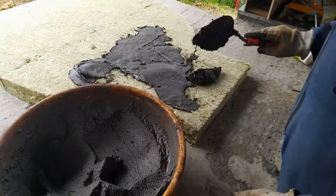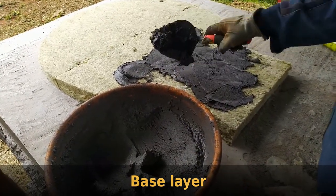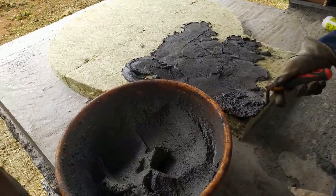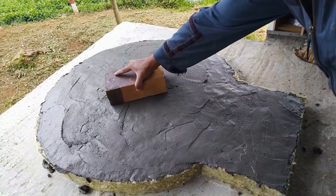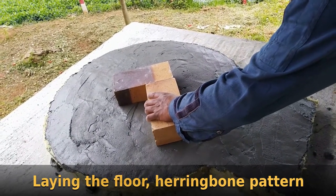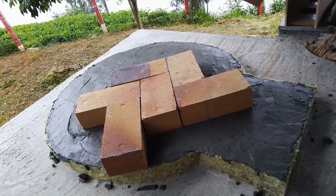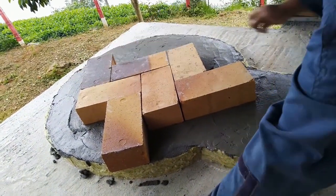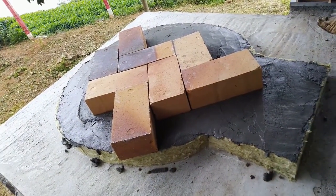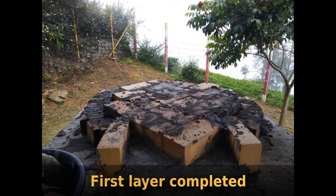Once that's done, I started layering the cement on top of the rock wool base. Then we start placing the bricks in the herringbone pattern. What would be even better is to put some kind of metal frame between the rock wool and the cement to give the cement more structural rigidity — I didn't do that, and in hindsight I should have. Anyway, here are the bricks going down in the herringbone pattern. Try to minimize the gap between the bricks.